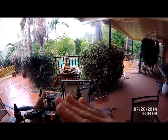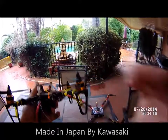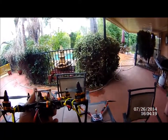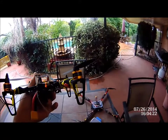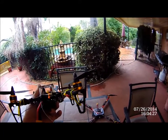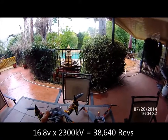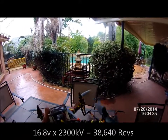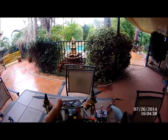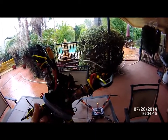We're flying standard HQ 5-inch props — 5x4, not 4x3, so they're a bit more angled. The motors are DYS BE1806 2300kV motors, about $8 each. If you do the math, running one of these with a 4-cell battery you're running over 38,000 RPM, and that's exactly what we'll be doing — flying 4 cells.